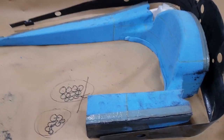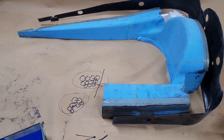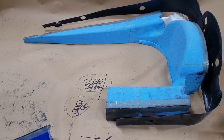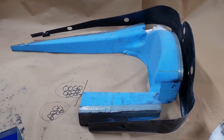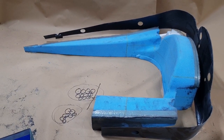Use a strategy which is called conventional machining, which I don't really want to get into now. I probably will later. There's climb milling and conventional milling. Climb is used in CNC machining. Conventional is used with manual machines, but you have to cut foam with the conventional machining strategy if you are going to venture into that.